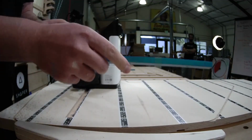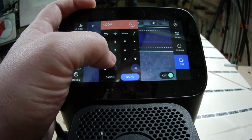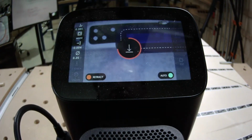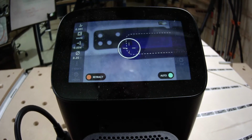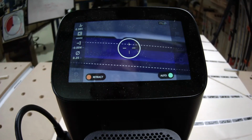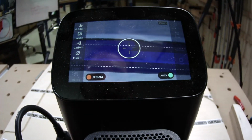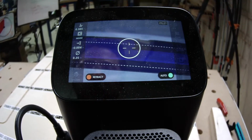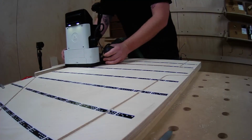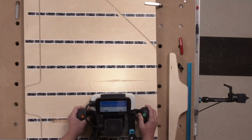Looks like not quite. Pretty tight. So going back in and adjusting the offsets again. Negative 0.004, which is negative 0.1 millimeters. And so a negative offset takes you to the larger, or takes more of a cut than 0 offset. So we're moving 0.1 millimeters or 0.004 inches outside of the digital boundary of that inside cut. So it'll give us, I think, ideally a little bit of just right clearance on this track.